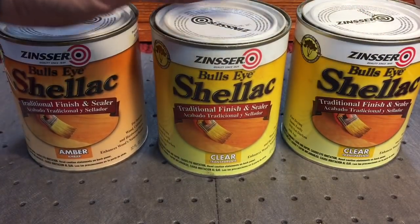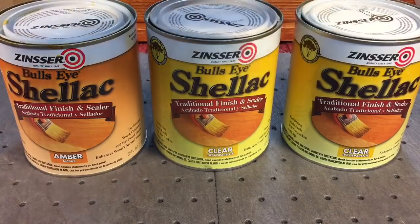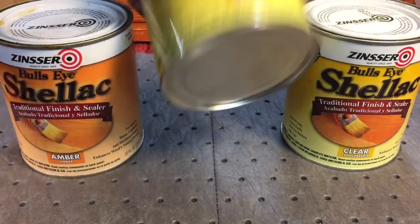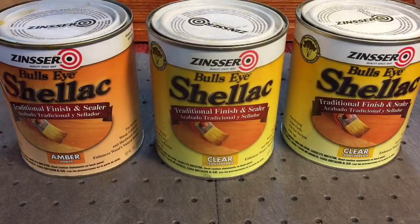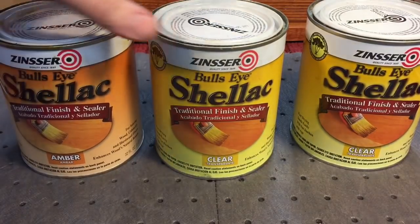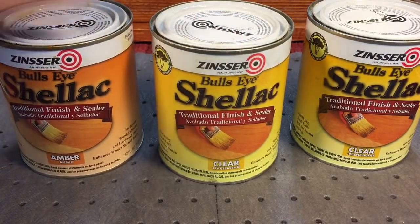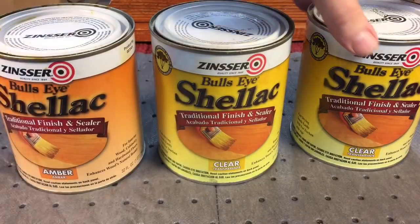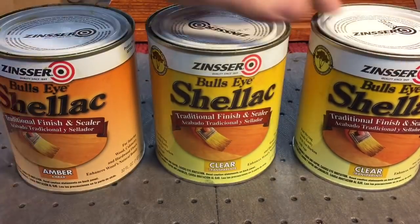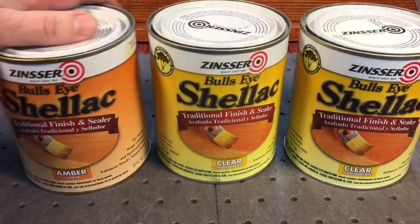Years ago woodworkers used to make shellac themselves — they would take bags of lac flakes and make it themselves. The only bad thing about shellac is it has a shelf life. Some of them, about a year, and they used to date the cans with a date code. Basically if you got a year out of it, it wouldn't dry as well. But the new shellacs they have today — some cans I've had over a year and it works fine, even two years. I've never had a problem with aging of shellac. Keep it sealed and you won't have a problem. Don't go to an old hardware store and find a dusty can and expect it to perform — try to get your shellac from somewhere that turns them over often. I get mine from Home Depot or something like that.